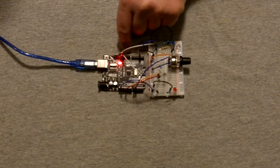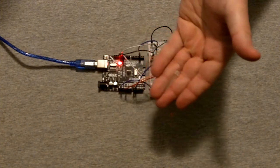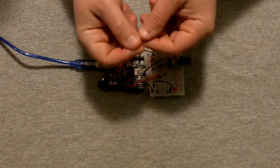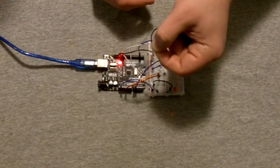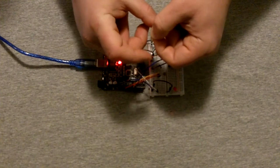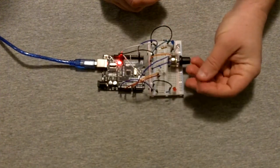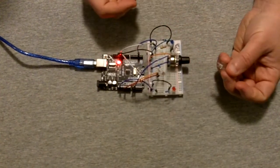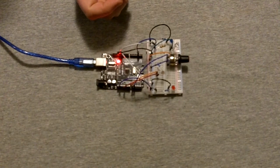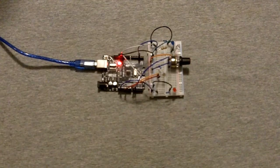Today's lesson is actually going to cover this multicolor LED, red, green, and blue. There's 4 leads on this LED. So the long leg should be the ground, but there's a chance that it could be a common positive and that all these other legs go to ground, because you have 2 choices with these multicolor LEDs. You have a common anode and a common cathode, and depending on which one was in the package will depict which circuit and which code we have to use in this lesson. So let me go to the computer view. We'll go over the diagram. I will wire up the board and we will continue from there.